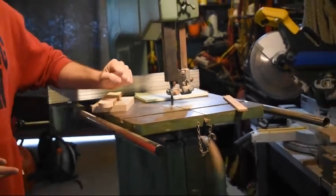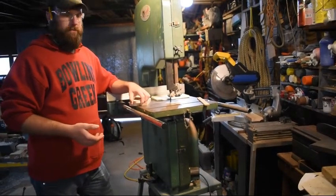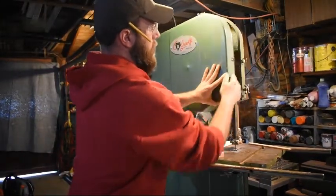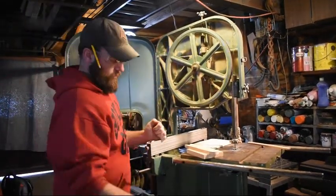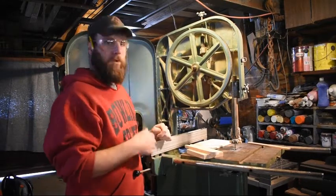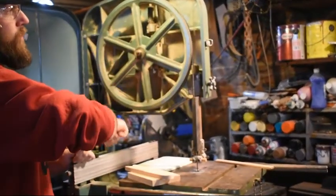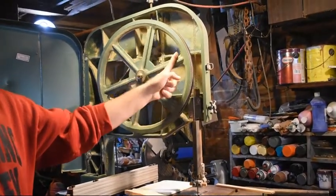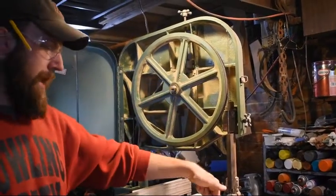In order to understand more of the safety, we also need to understand how the bandsaw works. To understand how the bandsaw works, we first need to look inside. Both above and below, inside the shields here, are great big cast iron wheels — there's one also below. The one below the table has the motor attached to it, and that's the one that actually drives. The blade is stretched all the way around in one big continuous loop. As that motor spins, it turns the wheels at a much greater speed, spinning the blade so that it moves in a downward motion.